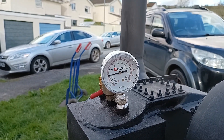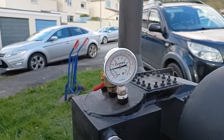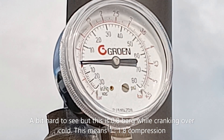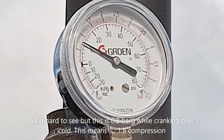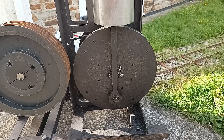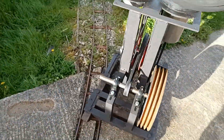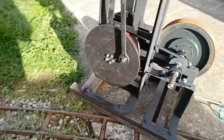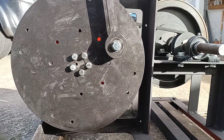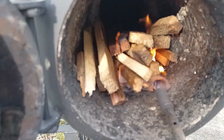I've just installed this pressure gauge. What I'm going to measure here is how much pressure it builds up on the compression stroke — this will tell us what the compression ratio is. The crank angle is just about over 90 degrees. That's reading about 100 to 120, something like that — yeah, more realistic.